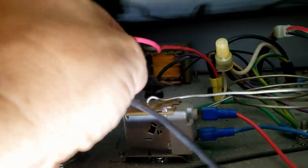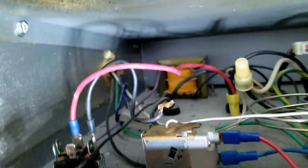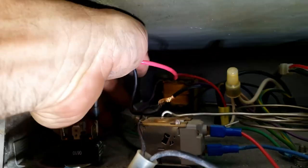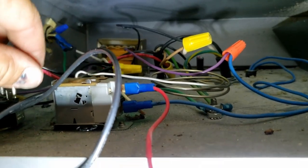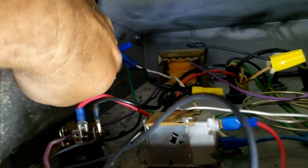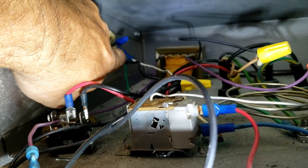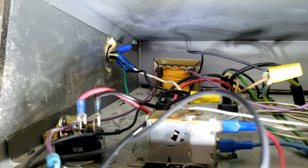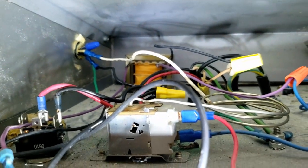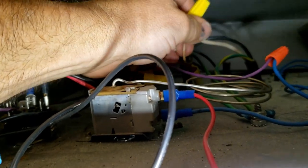As I'm taking this apart, this thing is hot. We're going to chop these wires off and get them stripped back - you can see the corrosion starting on it. Basically as he said, just unwire it from there, chop it off inside the rail, and silicone it shut so it's food safe. They had a plug that went up to the top and that's what we undid. The wires for the fan down in the cabinet - I screwed up and cut those, which is a good reason why you never chop all your wires off flush. If you make a mistake like I did, you won't be able to repair it. Luckily I was able to put butt crimps on there and repair it. I do screw up every now and again, but what you do with it is what's important.